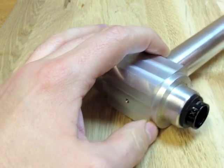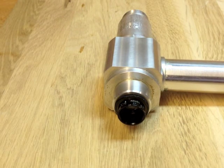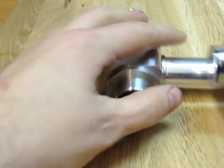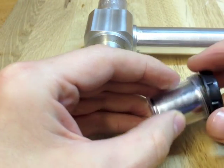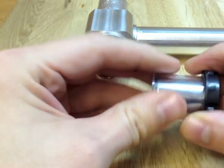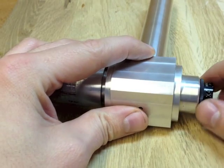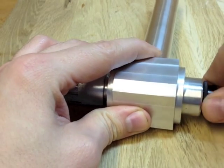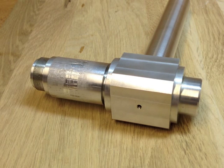That's just a 4x magnification lens, and in the eyepiece I'll have a 10x magnifier — that's the microscope eyepiece. Not amazingly high quality, but then again we're not doing traditional microscopy with these things. My original intention was to make the objective lens mount, or objective lens holder as well, because I do have a little lens to use in that spot — that's a 72mm focusing lens. But really I thought it would just be too much palaver to make what is already freely available for about a fiver on eBay.